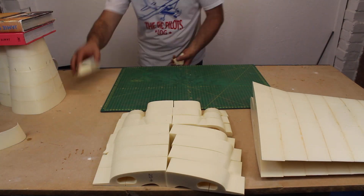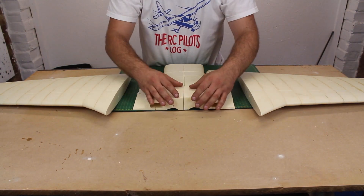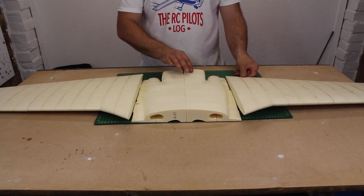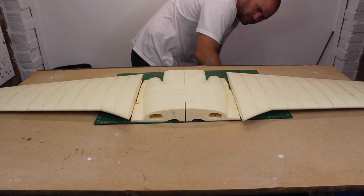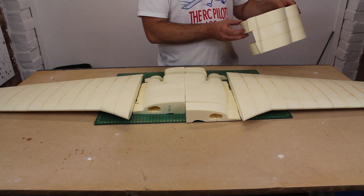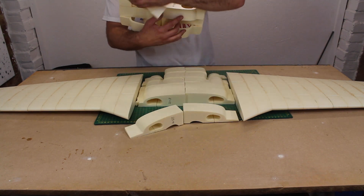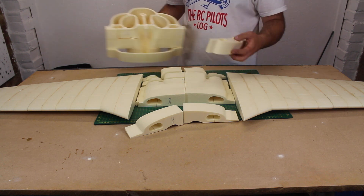I am almost certain I will make a one-piece wing using the lower profiles of the fuselage to form a centre and join the wings. The four wing spars will meet in the centre and be permanently fixed to each other. After some significant reinforcement, the centre section will mount into the fuselage in a tongue-and-groove style and be held in place with several fasteners. At least that's how it works in my head.